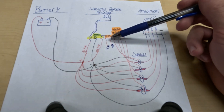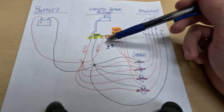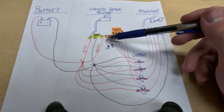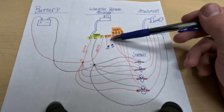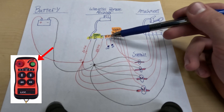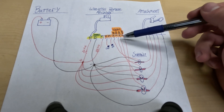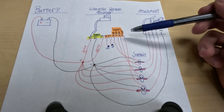Four and five I have just capped off — I don't run them anywhere. Wire four is just always on when the remote is operational. Wire five is the green button on the remote, which is an extra function that I don't need. Six, seven, eight, and nine — that's your up, down, east, and west.